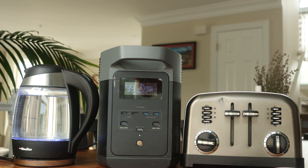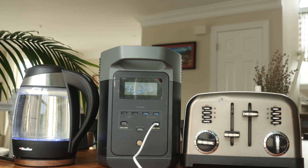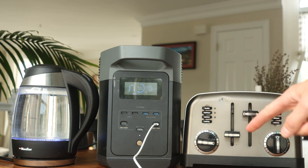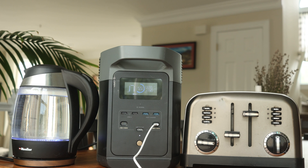Now for the EcoFlow under the same load. At 1,400 watts the fan definitely kicks on immediately. Adding the toaster and plugging in the laptop, I noticed something interesting: rather than maxing out and tripping its circuit, the EcoFlow will throttle down power output to the toaster and electric kettle — we're looking at 1,790 total watts, even though these should be drawing about 2,300–2,400 watts as we saw with the DJI. Both units have intelligent BMS. As for price, both are listed at an MSRP of $999 but are selling on their respective websites for around $599, or $529 at the time of filming. Links are in the description for the latest pricing.